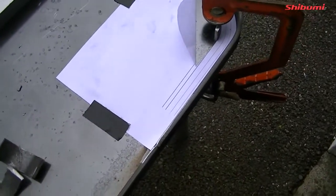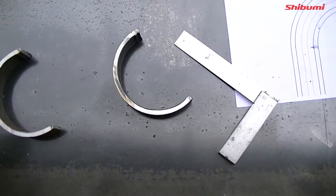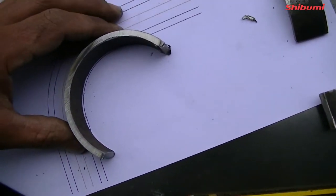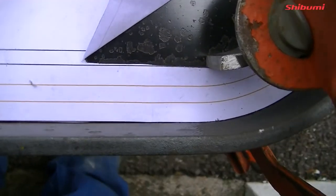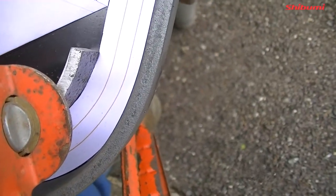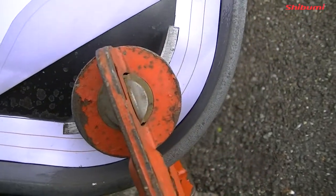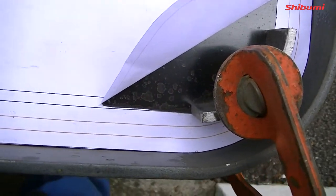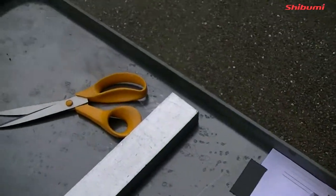So the inside corners are a little bit too tight for my bending gadget that I've made. So yet again, we're back to the pipes, which, funnily enough, are the exact dimension. So I have four pieces cut and I've used a template. So we're nearly there. And I'm going to just double check that now with the calipers to make sure I'm maintaining 20 millimeters of a gap, which is for the seal, and then I'll tack it on the inside. That'll all get fully welded up in its own time. So that's how I'm going to do it. Four corners to do yet.